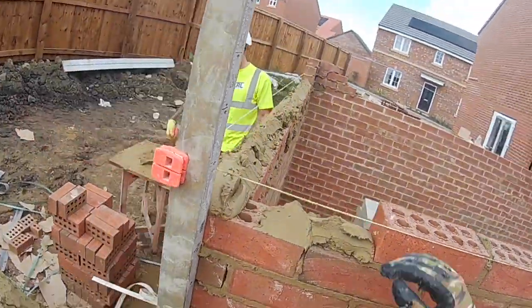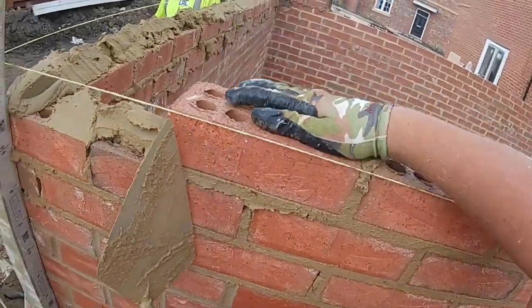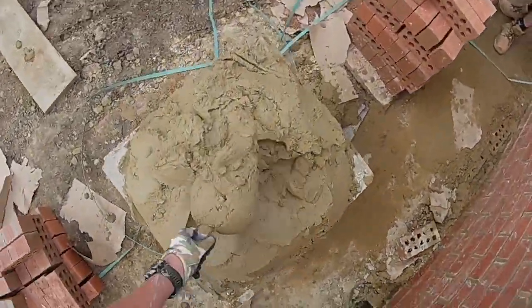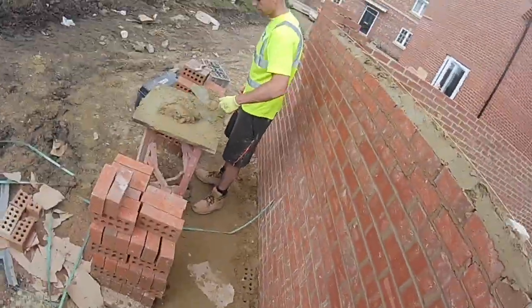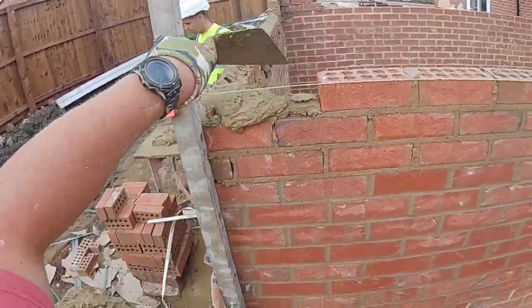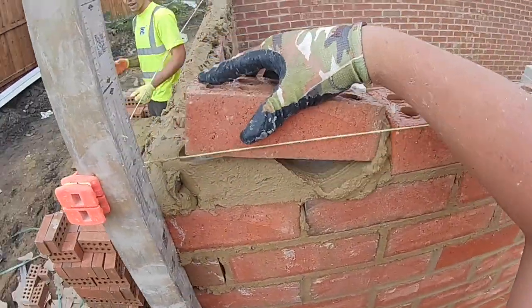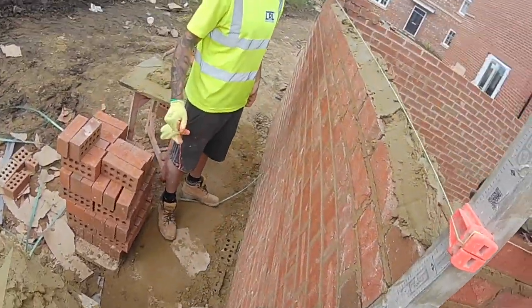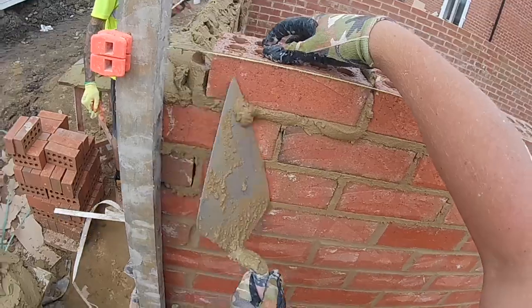I've seen it happen before. Seeing gangs use it, they just don't know a faster way of doing it. And leaving blocks out allows you to easily clean your cavities. And if you're on higher lifts where you've got damp trays over soldiers and stuff, you can either leave a block out, which isn't really ideal because it's right at awkward height, but leaving bricks out over that is one thing that people do. But the main thing is to try to keep them clean by putting a lot in your cavity and stuff like that.